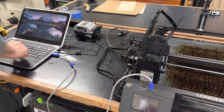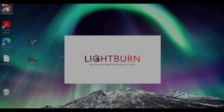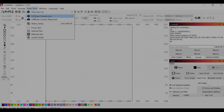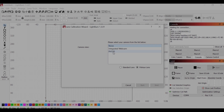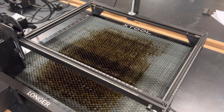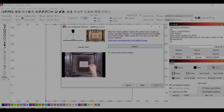At this point I was ready to connect the camera and power everything up. The Atomstack AC1 is plug and play, so Windows will install whatever drivers it needs to use it. I opened up Lightburn on my computer. I'm going to be showing how to do this on the PC version, though I imagine setting this up on a Mac is pretty similar. Once Lightburn opens, you're going to use Laser Tools and Calibrate Camera Lens. Then you'll select your camera — for whatever reason, this one shows up as PH 720. You'll set it to standard lens if that's what you've got, and do the full calibration, then click Next. The next several steps are going to include using the calibration card to line up the camera. Atomstack included one of these with the machine, but if you don't have one, you can download one through Lightburn and print it out. You just follow the positioning pictures and set the card in the same spot on your screen. Also, remember to deselect honeycomb check enabled — if you don't, it's very hard for the software to pick up the dots.